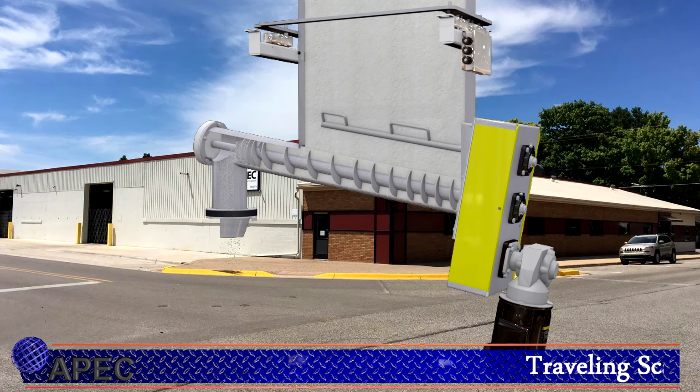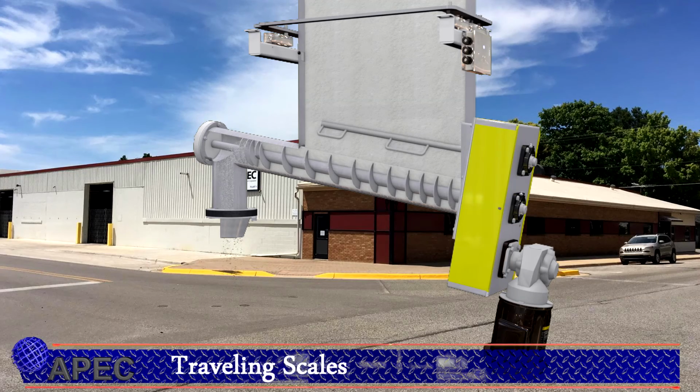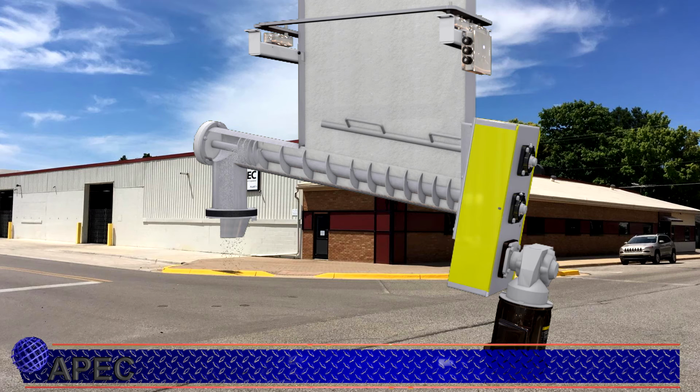By having that finer pitch and 3 stages at the end of the screw, it allows for a more consistent, repeatable metering of the product. In any application, no matter what the ingredient is, with a TSS versus a standard screw, you're going to get better accuracy and more consistent repeatability. What's nice about it is you can do this at higher speeds than you would if you went to just a finer pitch or a smaller size screw. With the use of a VFD, you can almost match the metering speed of a standard pitch screw with the better accuracy of the triple stage.